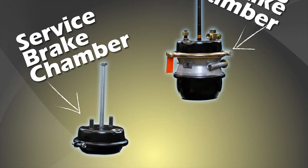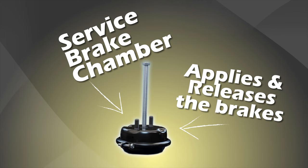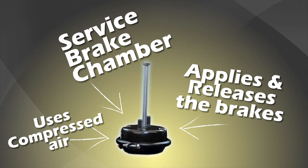A service brake chamber has one function: to apply and release the brakes. At its most basic level, a service brake works much like a regular hydraulic brake in a commuter car. The only difference is that one uses hydraulic fluid, while the other uses compressed air. Let's take a closer look.